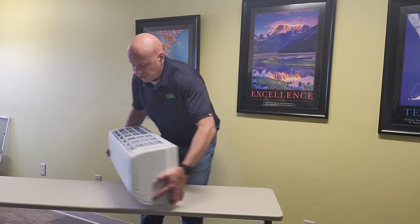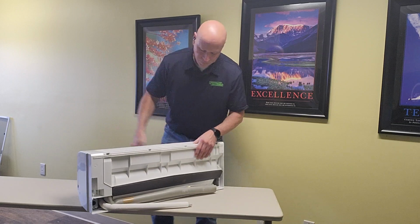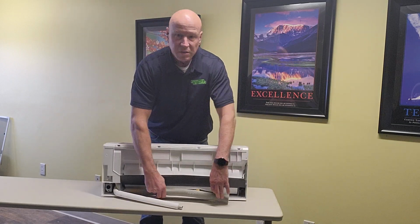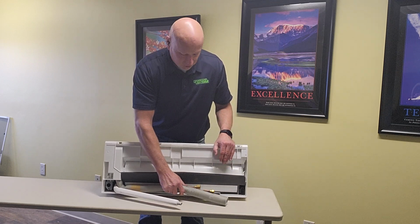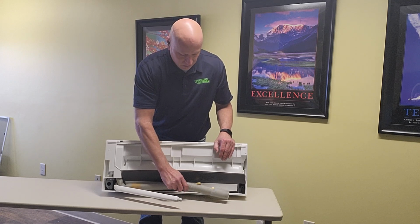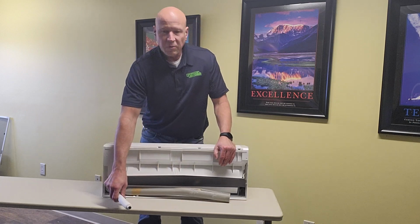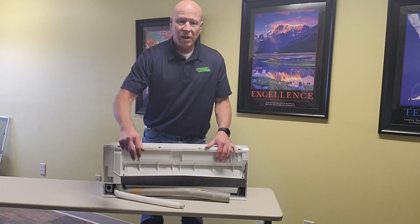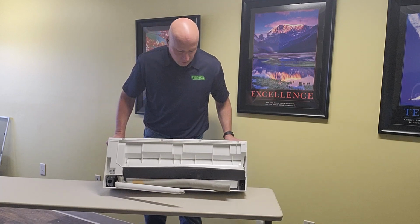If you're looking back, you wonder, well, how does this fit on the wall? There is a brace that you put this on, sort of like a lot of other things, a metal piece. But this is where the refrigerant comes in behind, like here. And that's what you would see going to your air conditioner if you had a system outside, that'll go into the coil that's above your furnace. This is the drain tube, so that it drains back to the unit and then out from there, and that's the unit that's outside. So that is what the back of it looks like.